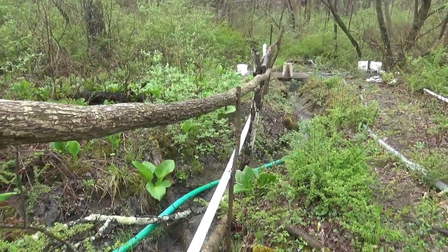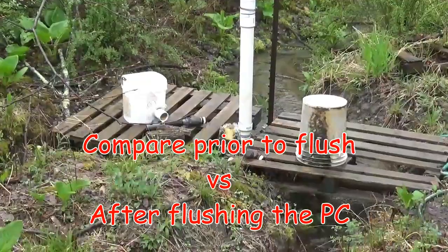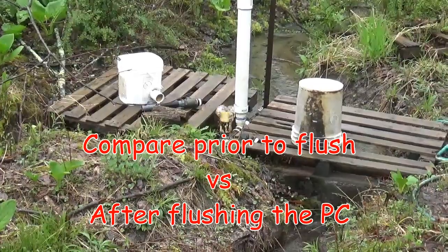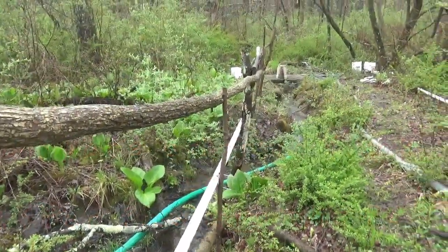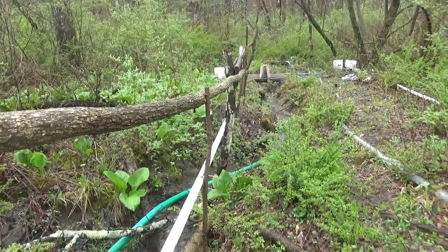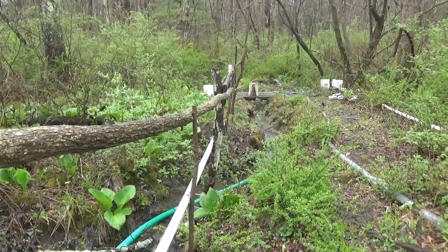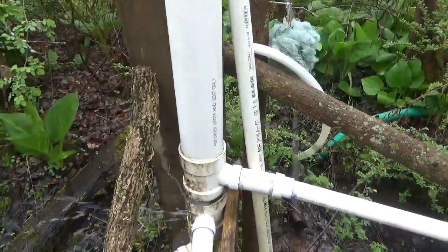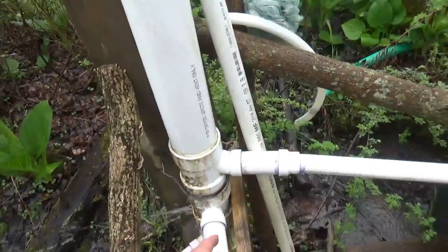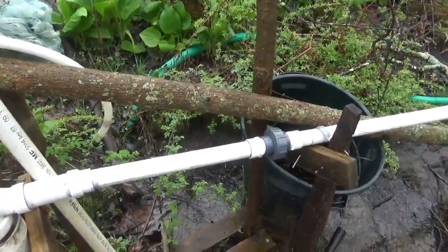Different frequency, different tone. This pipe still slaps a little bit because I don't actually have it anchored as much as I should — maybe we'll get to that this year too. But you can hear the difference. You don't hear all that energy coming back up the pipe in the shockwave. A lot more of that energy is getting transferred into the pressure chamber and consequently producing water pumping, without breaking the pump down or breaking the plumbing system that supplies the pump over time. Part of the reason I anchor it like this is so there's a little bit of play — so it can actually move and flex rather than trying to hold rigid pipe and basically tear fittings and pipe apart.